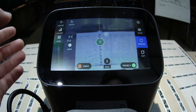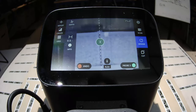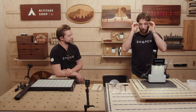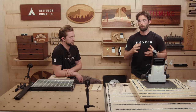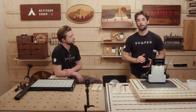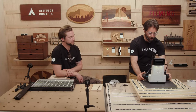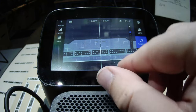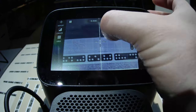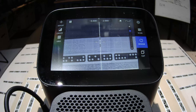I'm going to come in here, hit Grid, create a new grid, and lower this cutter for the first part of my grid — defining the X-axis. Two points, spaced nice and far apart. The next step is to raise the cutter, move above your line, remove the dust guard so you can see what's going on, and lower the cutter slowly so it's just grazing the surface. You can adjust the depth at any time during gridding by hitting the Depth button. Now I'm aligning the image with what my cutter is physically lined up with — but really go off what you see with your eyes, because while Origin is very accurate, there can be a little camera distortion. Align the physical tip of the engraving bit to your pencil mark in the center, hit Probe 3, and you're all set.